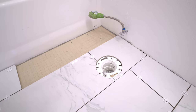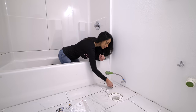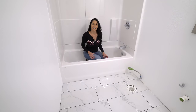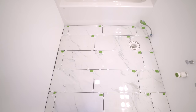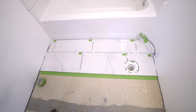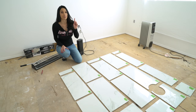It's a really good idea to pre-cut your tiles, especially if you're doing this project by yourself, because you don't want your thinset drying out while you're trying to cut pieces — especially if you don't get it perfect the first time and have to cut it again. I numbered all the tiles with a piece of tape on the upper right-hand corner so I know which order to lay them down. I'm also going to use a piece of tape as my guideline instead of drawing a line, since thinset ends up covering drawn lines. I also marked the wall where the tile ends.